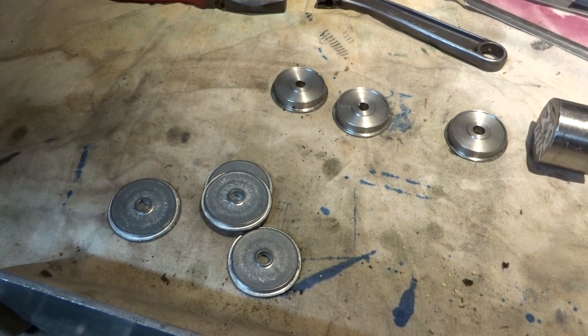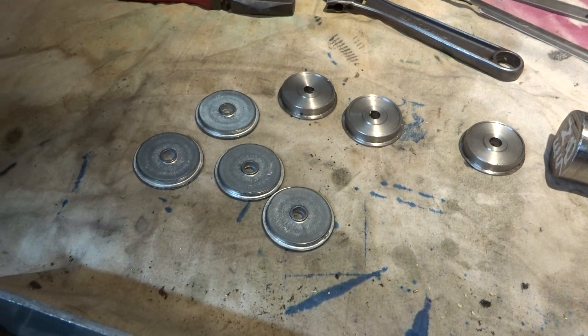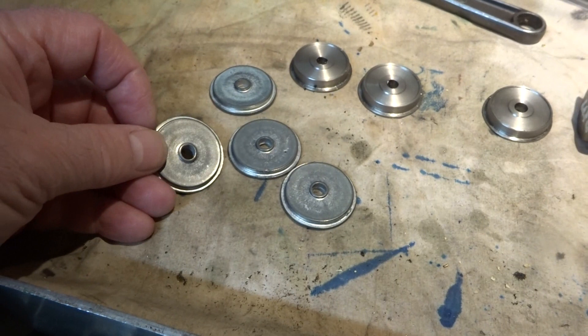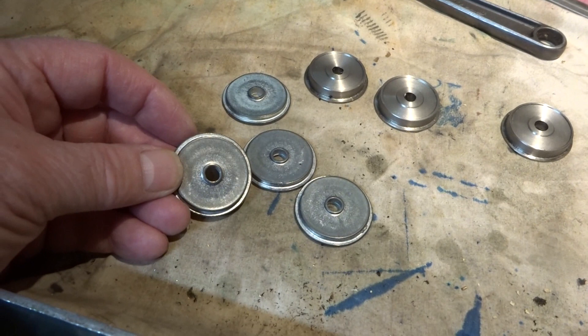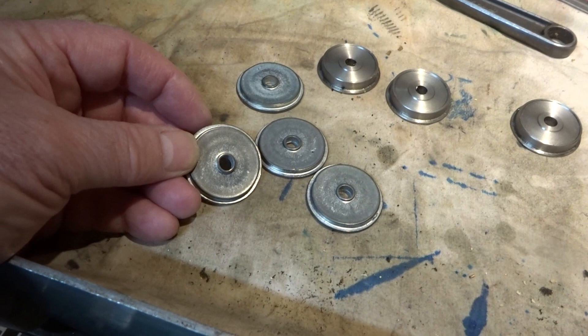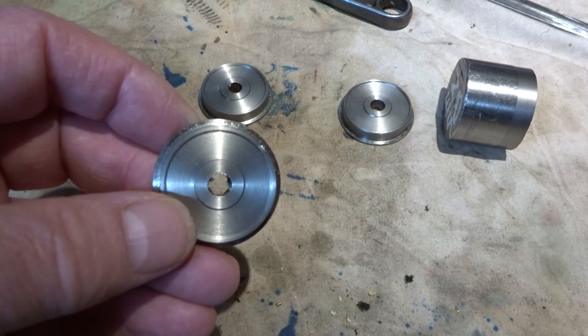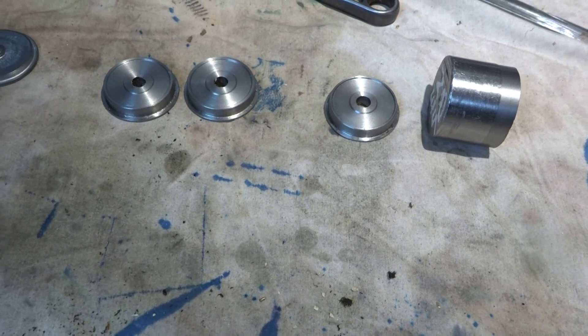These are the four wheels as supplied in this tram kit. They're okay, nothing wrong with them really, but they're very, very slim and in my view not fit for a garden railway. As per the instructions, they're simply glued to a bit of wooden dowel as axles, and that's not much good either for continuous running. So I found a scrap of stainless steel and I'm turning up four wheels from that for the tram.